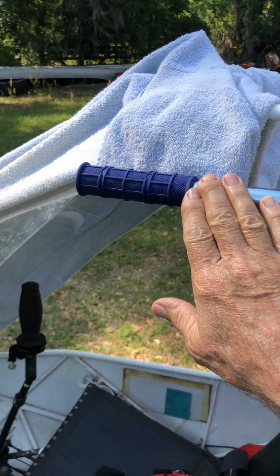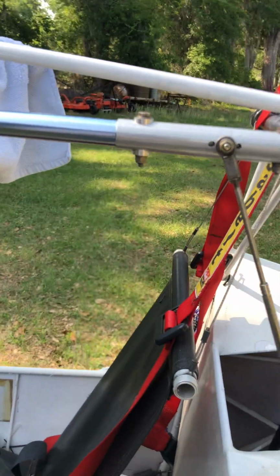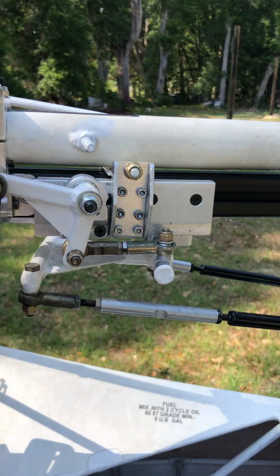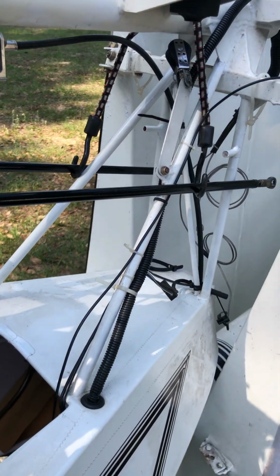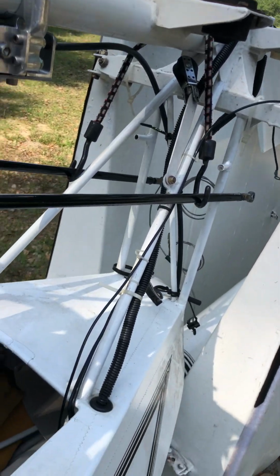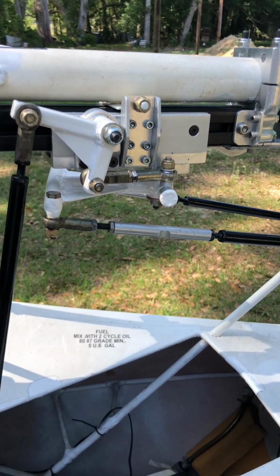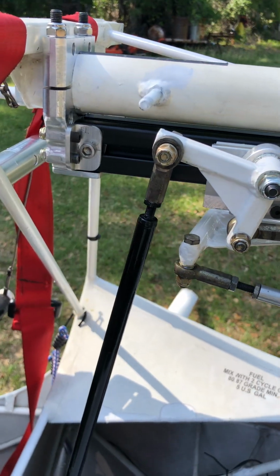This is the actuating lever, and it's presently in the neutral position, where the ailerons are neither reflexed down nor reflexed up. And as you pull this down from the seat, you can see it pulls the mechanism forward, which pulls the 2 aileron tubes forward, which pulls the 2 ailerons down together to make flaps. And here we go back, and that's in the fully reflexed up position. Right here is the neutral, and then moving it forward another 3.5 inches takes it to full flap.